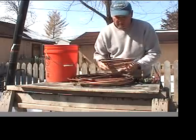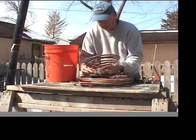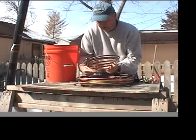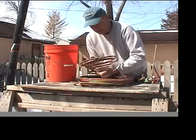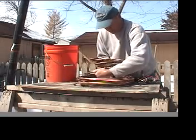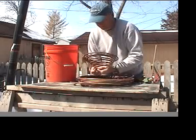It's possible to kink this tubing so you don't want to go crazy on tight bends, because if you kink it you're kind of done. You can do spirals in sections and weld them all together, but I don't like to do that. I just think it's more work than taking your time and getting these spirals nice to begin with. It's a little tougher as you get in tight, but it's not that hard.